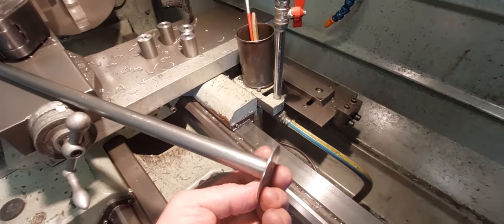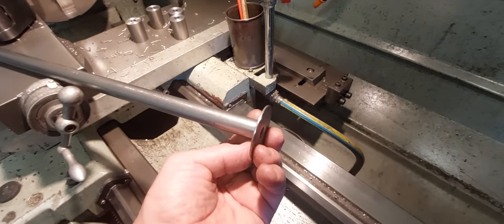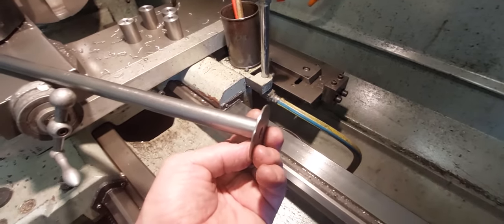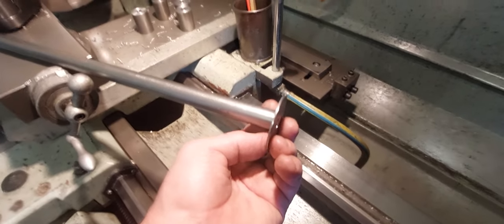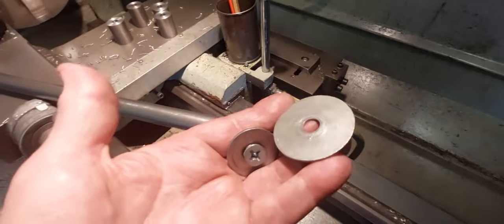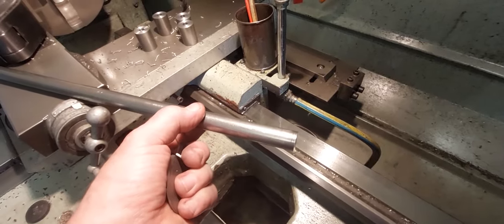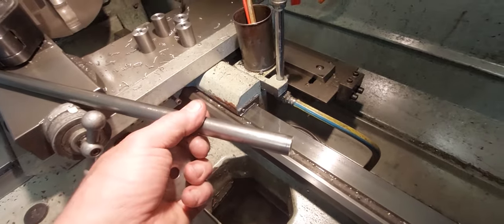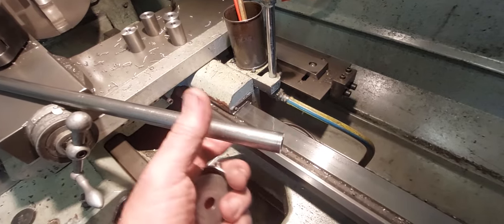I won't fast-forward — I don't edit videos yet, so you'll have to work with me. I'll do one and then bring you back to measure them all. You can put a sleeve in there to support it through your hollow bore — I do have it but you don't generally need it once the grub screw is done up. If you want it really accurate, I normally run a bush on this that fits the inside of your hollow bore, made out of nylon or any soft material so you're not marring the inside of your bore.